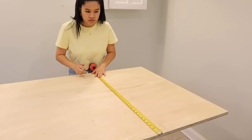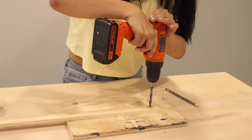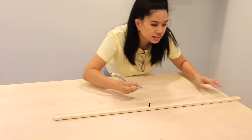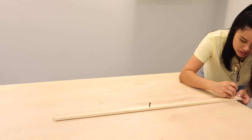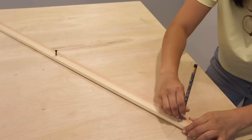The first thing I'm going to do is cut the top so that it's a nice arch. To do that, I'm going to make a little DIY compass so that we can create the perfect arch shape. We're finding the middle at 18 inches and using that as the midpoint to create the compass. You can totally do the string compass method — I've done that plenty of times — but I wanted to get a more precise semicircle. So I'm using some scrap wood; all you need to do is measure the distance from the midpoint to the top, which is 18 inches all the way around, and that's where you drill a hole for your pencil to sit in. Then for the middle, we're just going to screw it right into the plywood. Now we have the perfect compass that's going to create a beautiful arch shape.